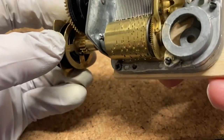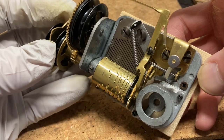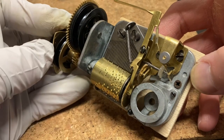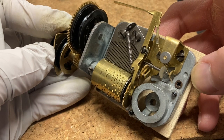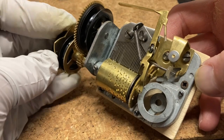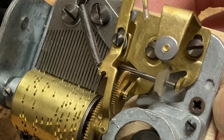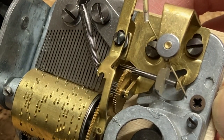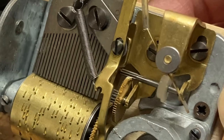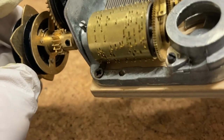Okay, so now it finishes the song and the plastic is stopping the fly. If you find the lever is too hard to push down and the clock won't actuate it, it's because your music roll advanced your lever so that it bottoms out on that shoulder pin and you don't have enough space in that elongated slot — it's still being stopped on the fly. So we're good on that. It finished the song, none of the teeth of the comb are being plucked, the plastic piece stopped the fly, and the stop pin is inside the music roll hole.